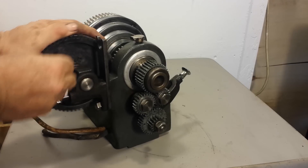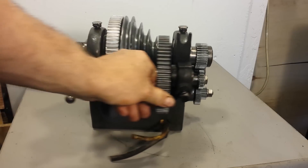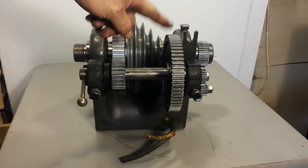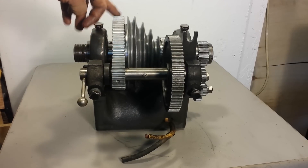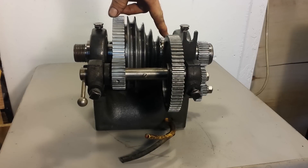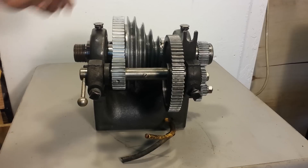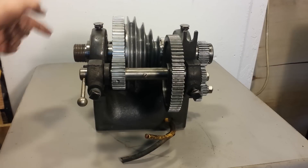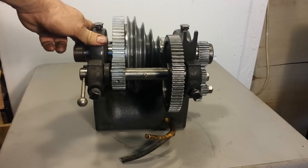All the other Z-Mac parts on the headstock here look just phenomenal. The back gear — take a look at that. There's a back gear system. Not a break, not a break in any of the teeth. This is an aluminum cut gear. These are part of the back gear system. So when you're not going directly from the pulley to the spindle, you go from the pulley to this gear here, here, here, to the spindle. And these gears, they just look like they haven't been used.